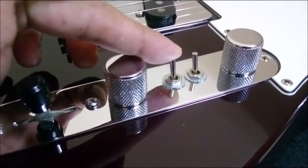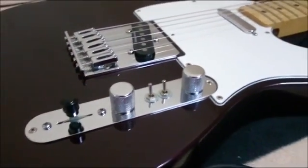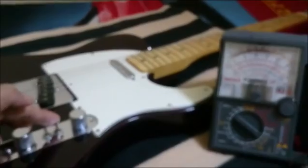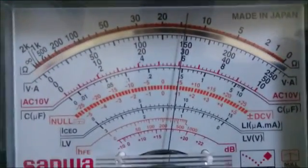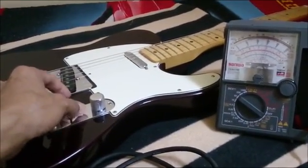This is the phase switch, which I will talk about in my next video. This is the series and parallel switch. It is currently switched to the parallel position — notice the change in resistance as I switch it to series configuration. From around 3.2 to 3.5 kilohms at the parallel position, it becomes around 13.2 kilohms in series. That means it will give a higher voltage output when the pickups are combined in series.